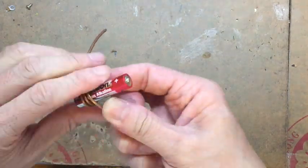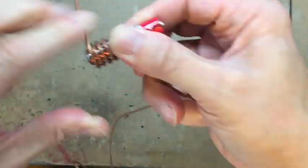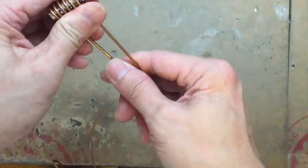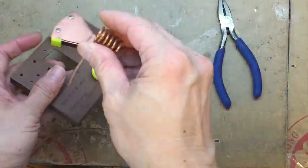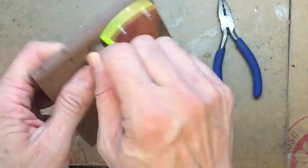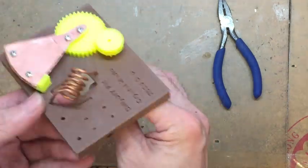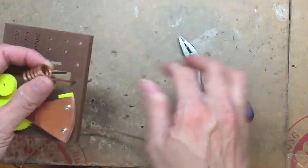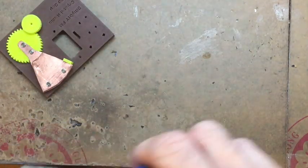The 2mm wire is a bit hard to wind and bend. You may want to wear gloves. Make sure you leave long legs, at least 3 inches long, in case you need to reach out to the other components. After that, you can insert it into the holes in the baseboard, and bend the wire a bit to make it in shape.